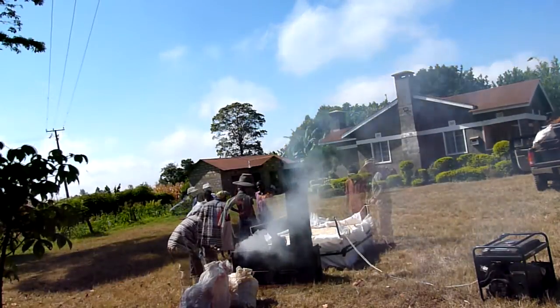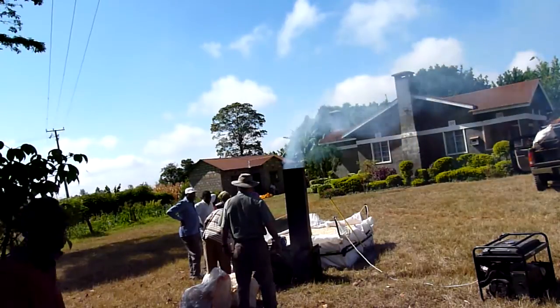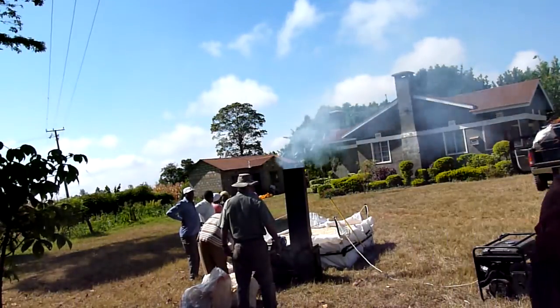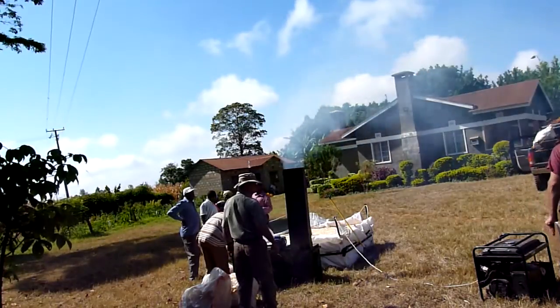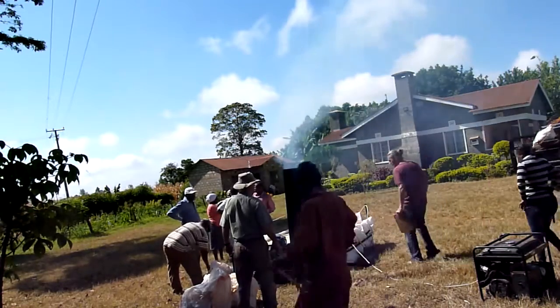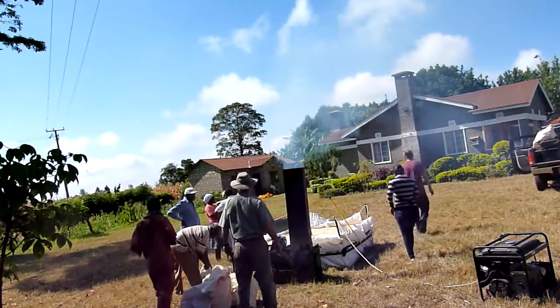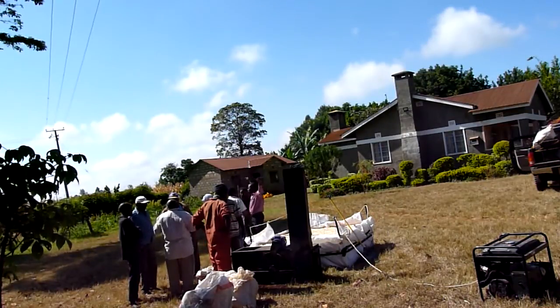As you can see just now, the smoke will start coming out of the chimney. The fan is on and now cold air from the outside is being pulled across the middle, across metal plates, so that the hot air goes from one direction with the smoke and out the chimney, and clean fresh air comes from the outside over the heat plates and back into the shallow bed so that the hot air then comes through.